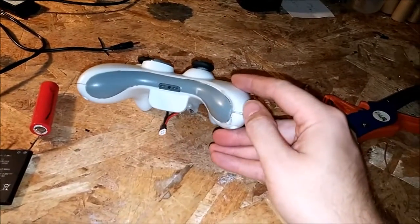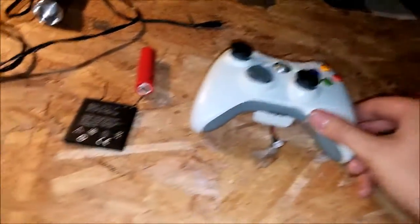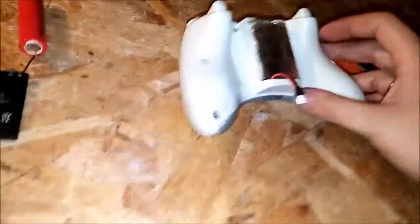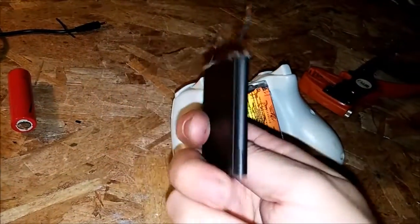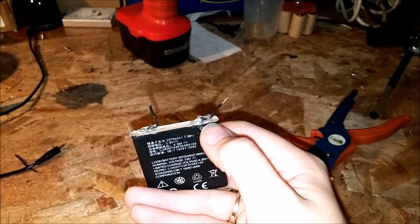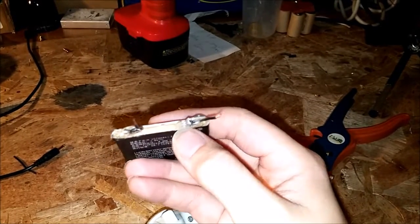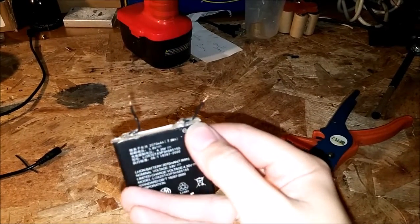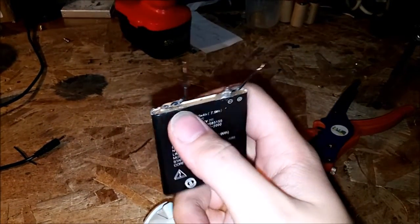This controller is pretty beat up. But that's how I converted mine — real simple. To be able to use cell phone batteries or something like that, you have to remove the top. And you want to be very careful not to rip the leads out of the battery. When you solder on these, solder it quick and then hot glue around these so that they don't short out.